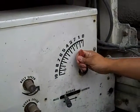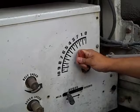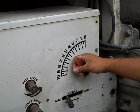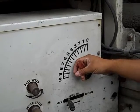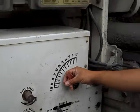Nice. In other words, if we need to dry it up, or if we need to wet it up a little bit to help it move, depending on what we have to do, because sometimes we're doing walls that need to dry up a lot quicker, and then we might actually go to a flat surface to where they need to work it a little bit more. So we can add a little bit more water and give them a little bit more time.